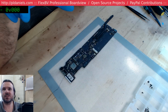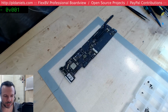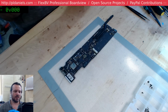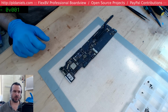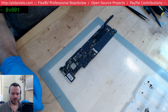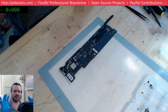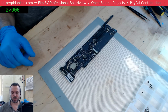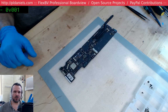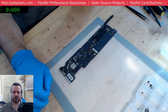Hey, Greg. When you use DD Rescue, do you put the image file on a USB 3 hard drive? Greg, the way I have my DD Rescue system set up is that I have a normal PC. It's only an Atom PC. I have my 8TB storage drive, which I actually need to replace soon. It's getting pretty old. I might jump up to something like a 15 or 12, something around that size. And then I boot from a separate Linux drive. I have a docking module which has a USB controlled power switch on it. And so I load up whatever I'm trying to rescue. I clone the image of that device onto the 8TB drive, and then of course do all my work off the image rather than off the drive itself.